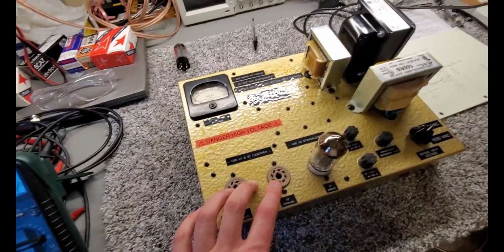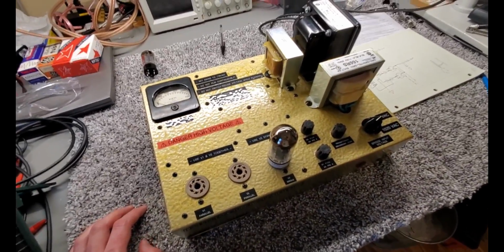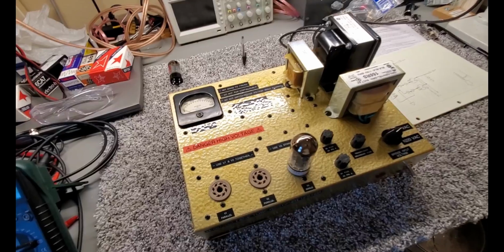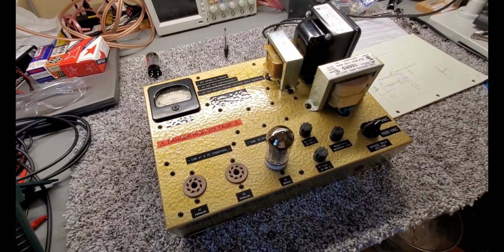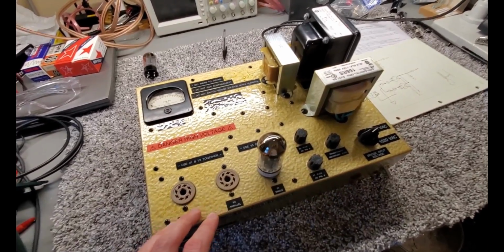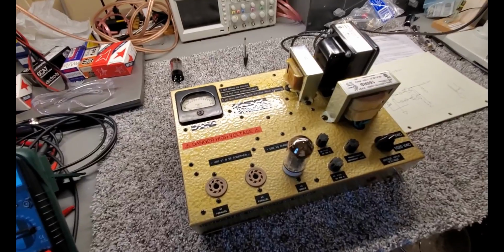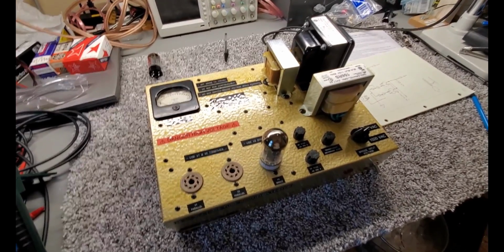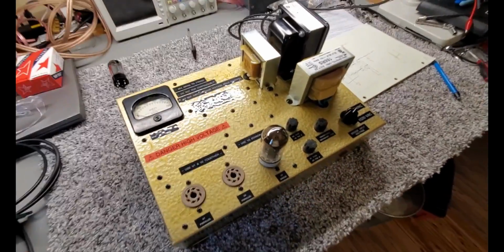They're just not tested. Vacuum tubes especially, like I said, in the last couple years I've seen throughout the 2845 project and with our other products, just can't really be fully trusted. You have to really test them exactly as you're going to use them in the product. For all the nuances I discussed here, you really have to test them exactly as they're going to be used in the product to ensure that they work. And they have to work. We expect our customers to be happy with our products, and our products aren't cheap. So with that comes things like this.